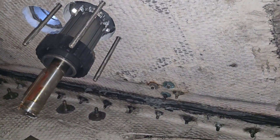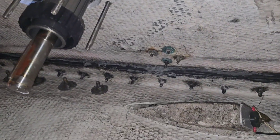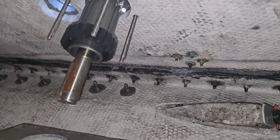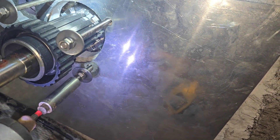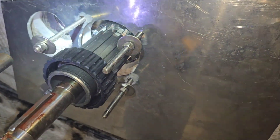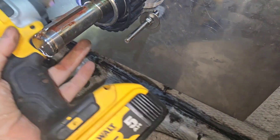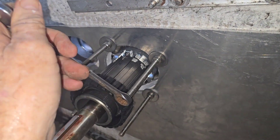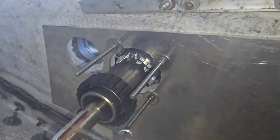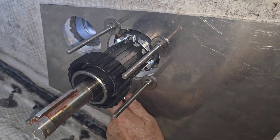This is our backing plate going up against the deck inside the anchor locker. It's a tight spot and I need two hands. The backing plate is in place with all the nuts and washers — let's run them up as far as the socket will take them, and we'll finish up with a wrench since the socket isn't that deep. Making sure they're all snug and I've got all the deflection out of the backing plate — four bolts equally tight.